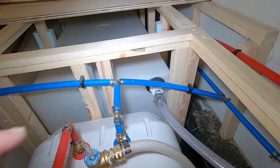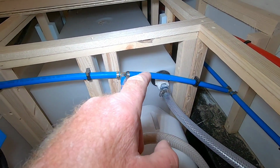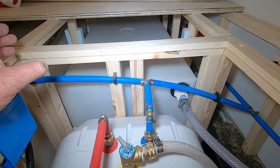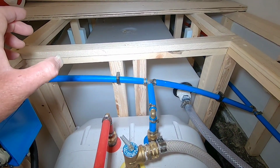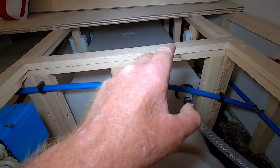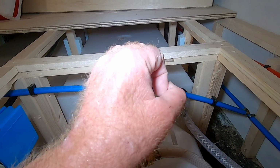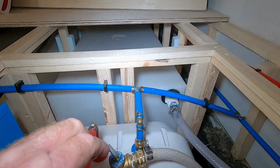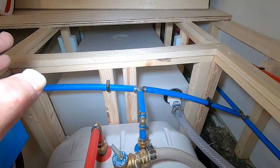So what I've got on this end, of course, is the entrance for the kitchen sink drain. On the other end, I installed one for the shower sump pump that we utilize, because I wanted the inlet in a certain spot on the tank. And then, of course, I vented this tank to the outside of the trailer with another Uniseal fitting on the other side. I could have used the 1/2-inch vent that was there, but I wanted a larger vent because I knew a lot of water would be coming into this thing, especially if we're working at the sink and someone's taking a shower at the same time.